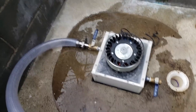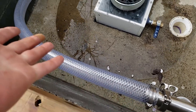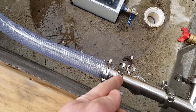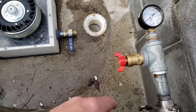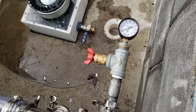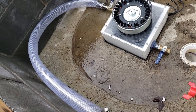A good reason why I need the valve at the turbine and not up here like it was previously is because there's bound to be air in this line — if you shut it off up here, some air is gonna come in as water leaks out. So just make sure everything's shut here. That's shut, that's shut. I'm gonna turn this on and we'll see the pressure creep up, not until the water actually fills most of this line, so let's do that.